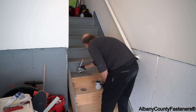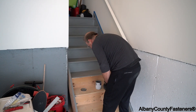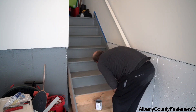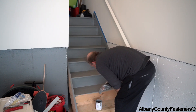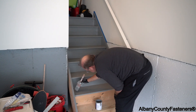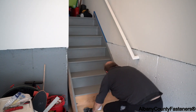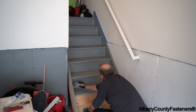This is an old pine stair. Yellow pine is what you typically use here; sometimes I use ponderosa, another species of pine. You use a lot more paint on your first coat, and you'll see that each coat after that uses a lot less paint. Basically it starts to seal up all the pores, and it gets faster to apply the paint with each subsequent coat.